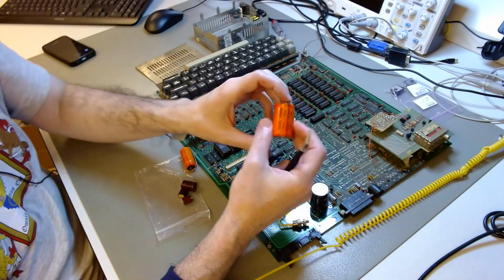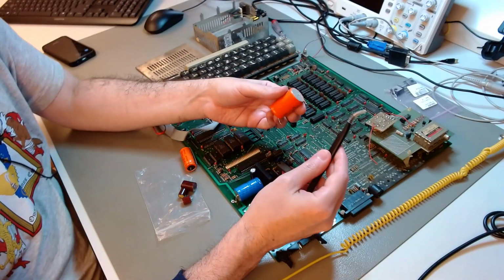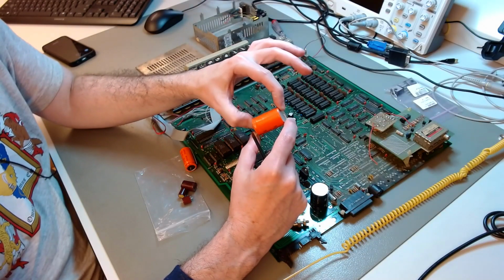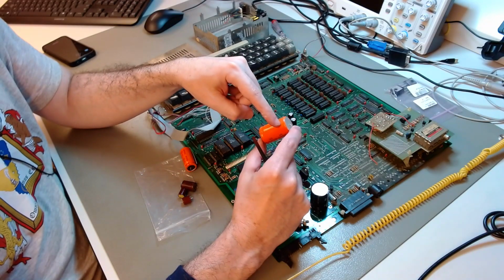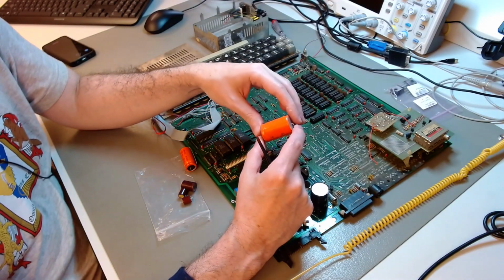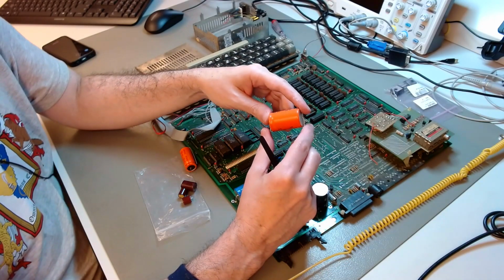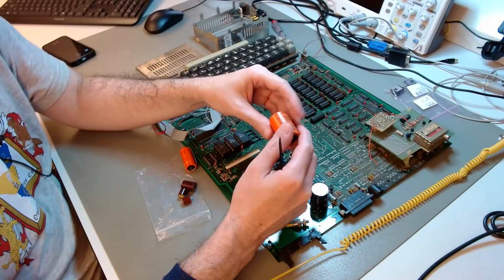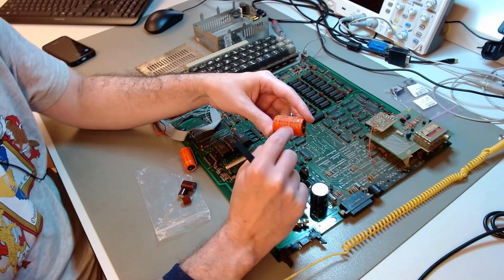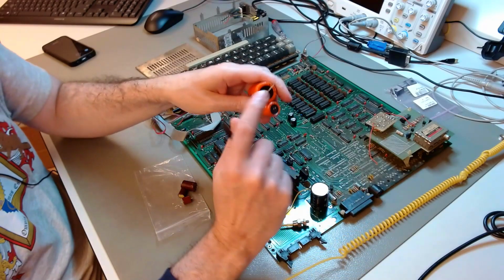The capacitance is measuring a little higher in one of them than it should be. This is normally a sign that there is DC leakage going across, because the way the meters work is they charge the capacitor, and they measure how much current is needed to reach a given voltage. When there is DC leakage, the current that in principle the meter is thinking is going to be used to charge the capacitor is just passing through. It's not charging anything. So it will take more current to charge it because of the DC leakage across the dielectric. And the meter will think, oh, it's a bigger capacitor. That's why old capacitors often read at a higher capacitance than the original. And some people think, oh, it's good, right? More capacitance is good. Well, yes, but in this case, it's not more capacitance, it's just DC leakage that the meter misinterprets as a higher capacitance. So one of them was measuring higher.